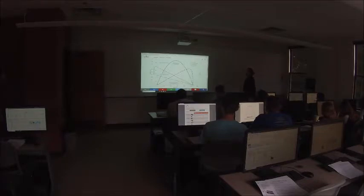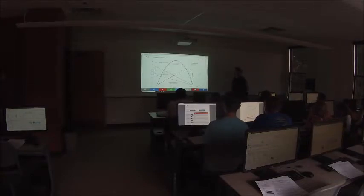Then this red line here is basically just the efficiency, right? Basically, how much electrical energy am I turning into work is really what that red line represents. So you can see it peaks somewhere around 75, 80% of the free load speed. Now, when we get into the build season, we're going to design gear trains mainly for our drivetrain. And when we're flooring it across the field, we typically design our drivetrain to top out at about 80% of the freeload speed of the motor.